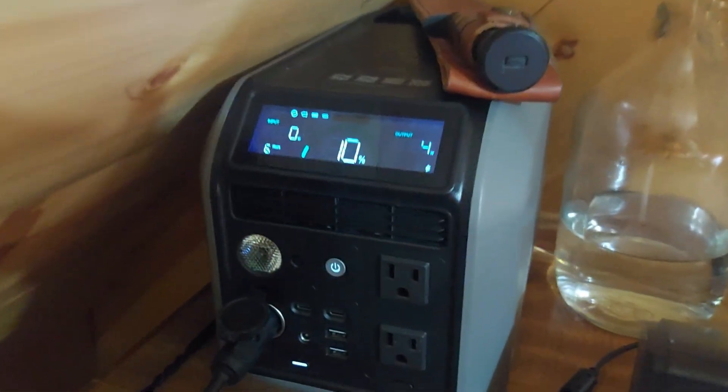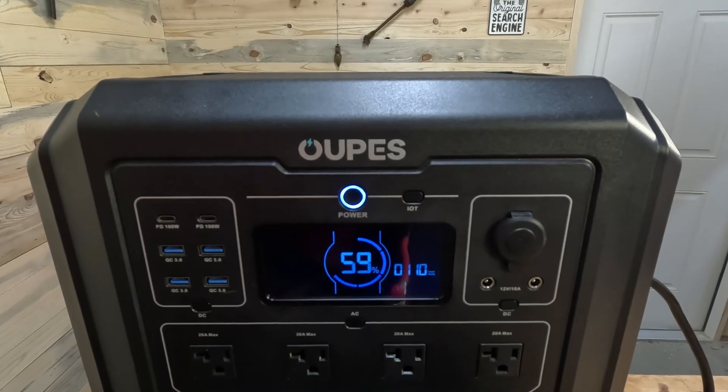If we're talking about taking a power station out camping and you need a CPAP, how long is it going to run? The most important thing to understand is that most CPAPs come with an AC adapter, and those actually take a little more power than running the CPAP off DC. Running a CPAP off a power station on the 120-volt side uses the inverter, and those inverters can use anywhere from 20 to 50 watts to run — meaning over an eight-hour period your power station may be depleted by as much as 160 to 400 watt-hours just running the inverter.